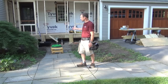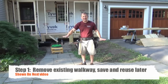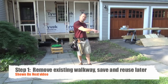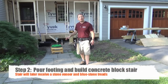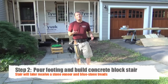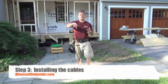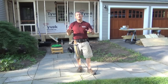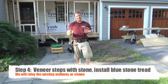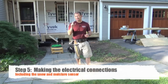The way we're going to do this is we're going to remove this walkway, relayer it with sand — a nice level sand base — and run our green coils in a serpentine fashion, then run them all the way up some masonry steps. We're going to rebuild these stairs out of stone using a concrete block so we can layer and serpentine-fashion install our coils on it, then veneer with fieldstone on the sides and risers, and cap the treads with two-inch bluestone treads.